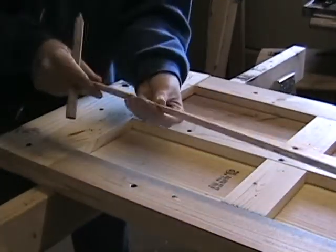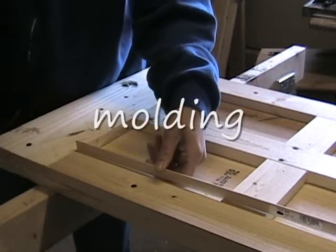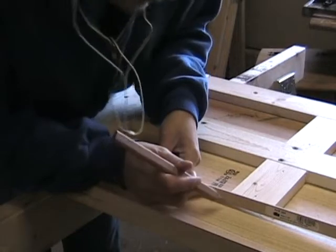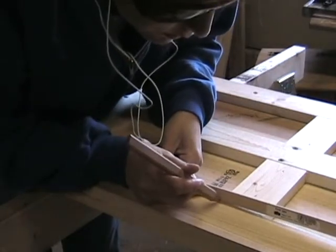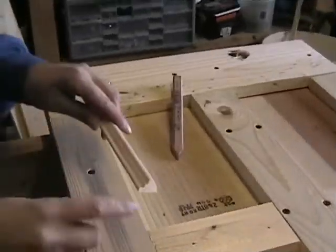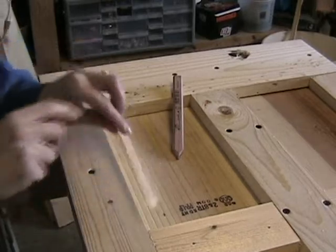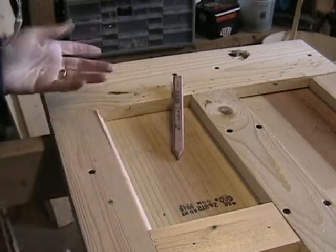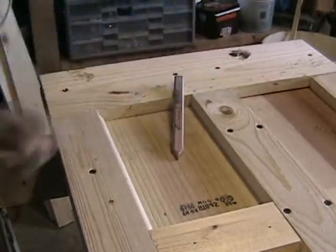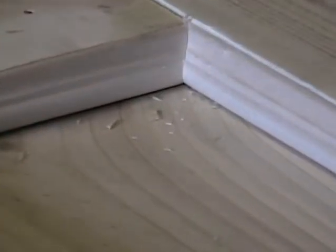This is just a little molding you buy at Home Depot — pretty cheap. Get it lined up right there, get it to where I want it, mark it, and then cut it at a 45-degree angle the opposite of this. After a little tiny fine shave because it was a hair too long, that's perfect. So I'm going to do this to every space in here and get that molding in the corners — makes it look a little more finished.